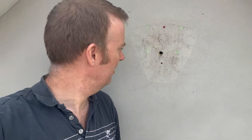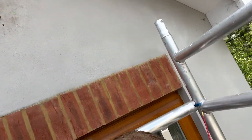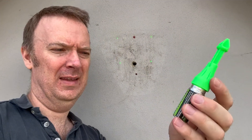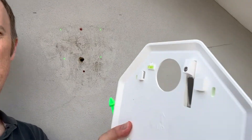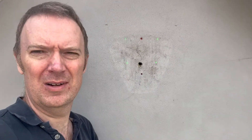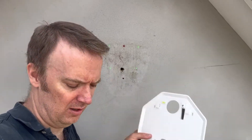I'm still up high and I've drilled out this hole with a 12mm drill bit so I can poke one of these rods through to find the cable on the other side. While I'm up here I'm also putting the bracket on. I used one of my favourite tools — the Marksman professional marking tool — which makes fantastic little green holes even for deep cuts where it's really difficult to get a pencil in. Marked up the holes, done some drilling, and now trying to find the other side of this hole in the loft.